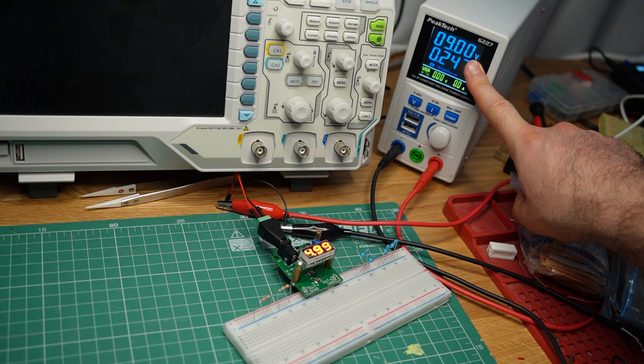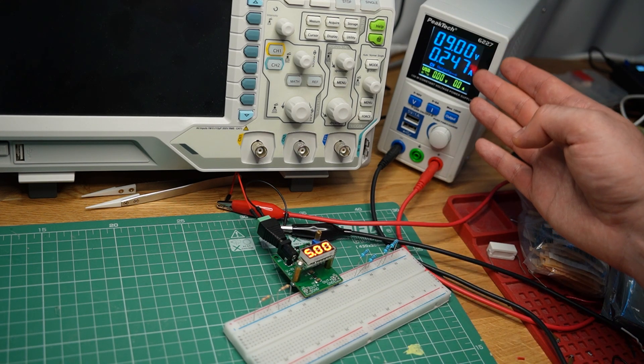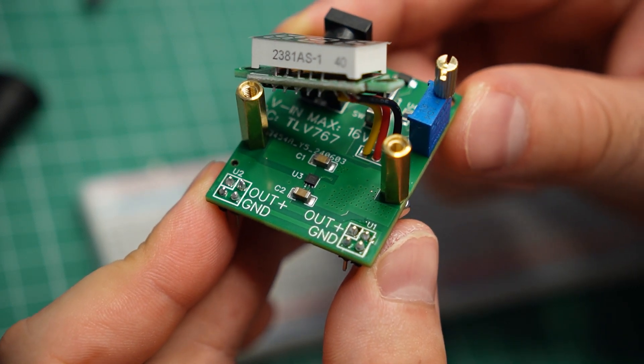As expected, reducing the input voltage from 12 to 9V took care of the overheating issue. This type of regulator generates more heat when there's a wider gap between input and output voltage. So my first version of a breadboard power supply does not perform as well as I hoped — it kinda works, it is usable, but that 200mA output limit is just not good enough. If I ever get around to making a better version, I have to figure out how to deal with the heat. One option would be to modify the layout of the PCB, and hopefully that could give it better cooling properties. But I have a feeling a much more effective solution would be to use a different chip, preferably something with a switching circuit. Should I try that? Let me know down in the comments and subscribe to my channel to never miss any of my future videos.